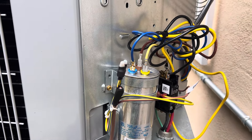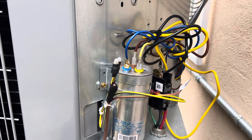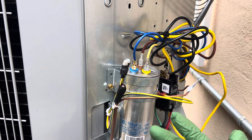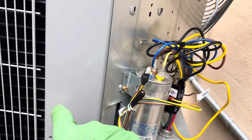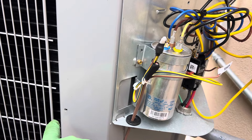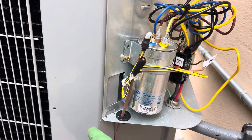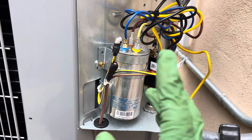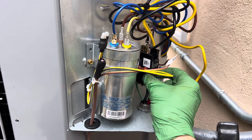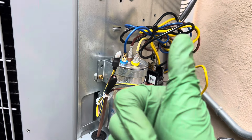This is about as simple as you could get for a startup. It gets even simpler if you had a three-phase connection — three-phase condenser fan motor and three-phase compressor — because then you would not need a capacitor at all. You could just have a contactor only. See you guys later.